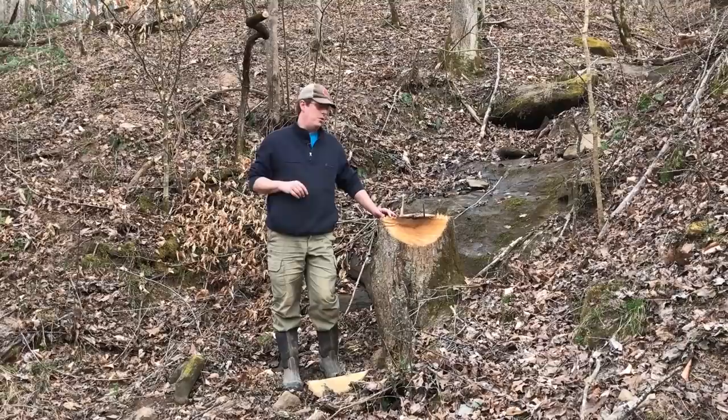So I think we're gonna stop there because we've trashed a blade. I have to go look and see if it's broken teeth or anything like that. But when it came through there, it automatically adjusted the set on it, it screwed it all up, and the sharpness of it. So it kind of waggled all the way down the rest of the log. So I knew there was something up there. So that's unfortunate, but that's why we buy blades by the 20 pack.